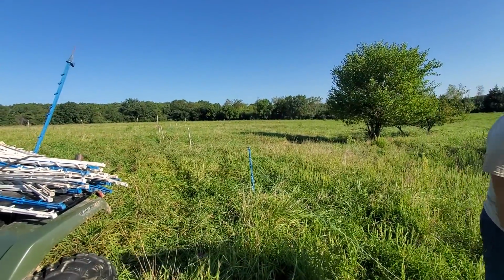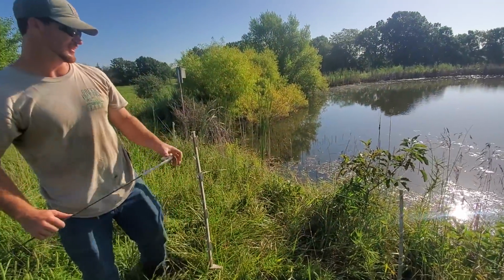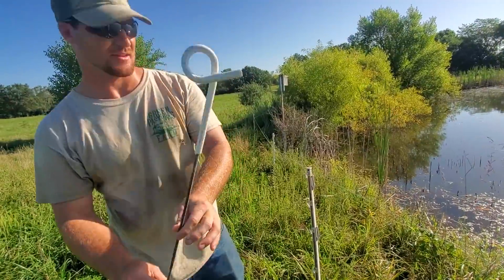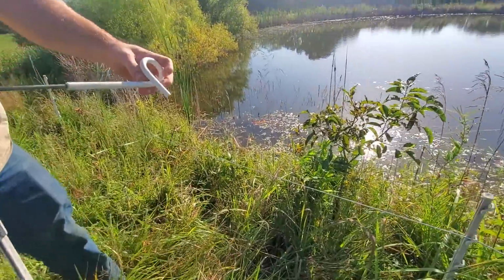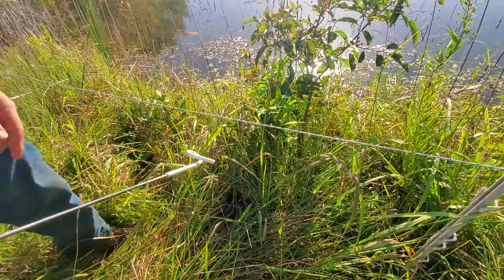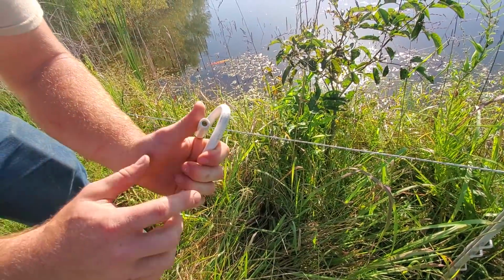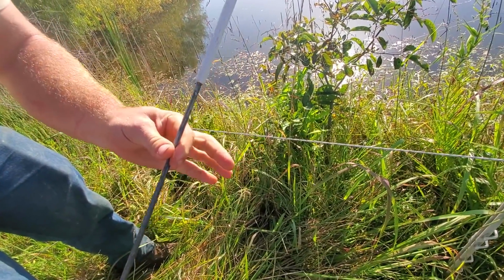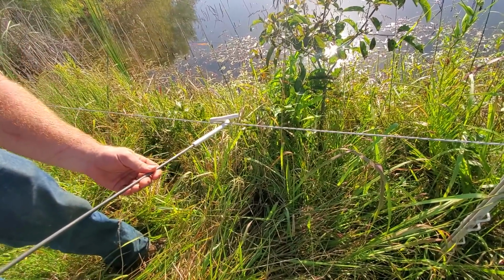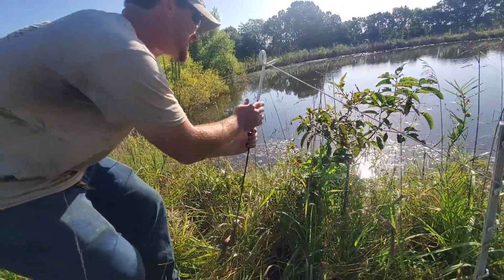So what kind of hookup are you gonna do here? I don't see any place to hang that reel. All we have is poly braid. What are you gonna do? So we're gonna take a pigtail. Then you take the open end, slide it underneath, and I got to be real careful because this fence is super hot, so you don't want to touch. Sometimes they'll have like metal here. Definitely, if you're touching this metal piece, you do not want to touch that to the wire. So you just slide it in right there. Well, you're being awful cautious there. I know. 10 kV doesn't feel very good.